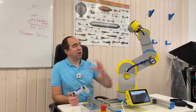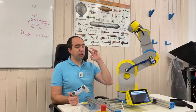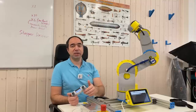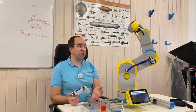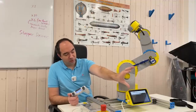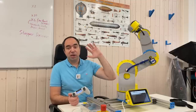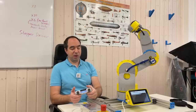In this video we have significantly improved this robot arm. First of all, by changing the motors — we changed three motors out of five. Right now it's more powerful, there is no skipping of steps, and the motors are quite cold, usually not going hotter than 30 degrees, at least without payload. We also installed the Raspberry Pi with the touchscreen — it's integrated and powered from a single 24-volt power supply. It's very convenient: you don't need a separate PC to run this robot, you just need to plug in 24 volts, have your joystick, and you can play with it.